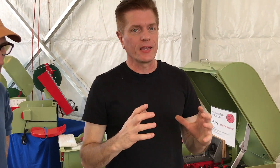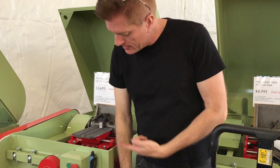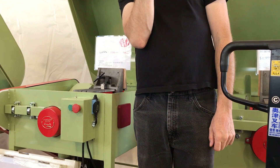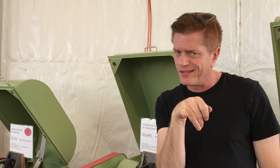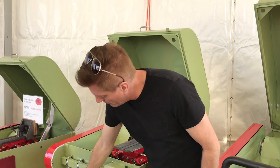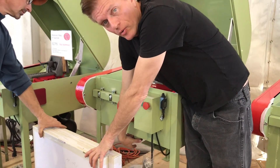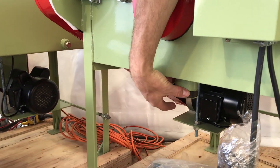Drains — so big thing when you clean this off. Having a drain like the Covington has a drain come out the side; it's on the other side of the saw and it's smaller than my finger for their 16-inch or 18-inch saw. It's terrible, it's a stupid idea. The drain should be on the bottom. So all our saws have a two-inch throat drain, so it's big.